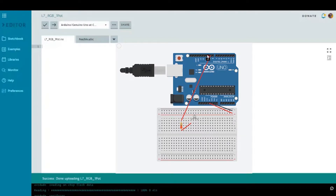I'll quickly switch these wires over to red so we can tell what's what, then we'll do this for green and blue as well. Green is coming out of pin 10 and blue is coming out of pin 11. We're going to put resistors in between each of these — a green resistor for green and a blue resistor for blue. So pin 11 goes through a resistor into the blue pin, pin 10 through a resistor into green, and red through a resistor into the red pin. For the missing cathode pin, we just wire it to the ground row of the breadboard to provide grounding for the LED.